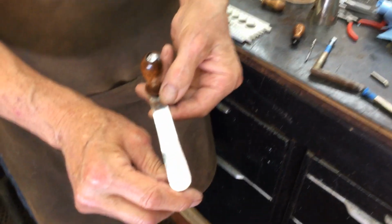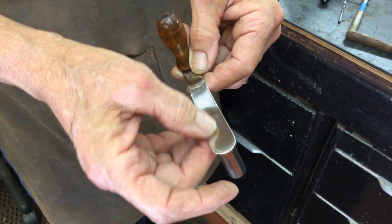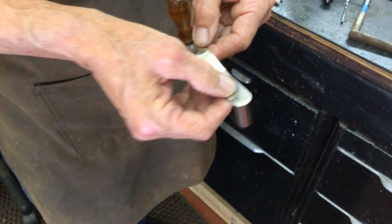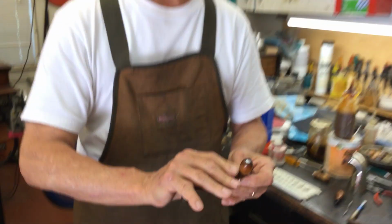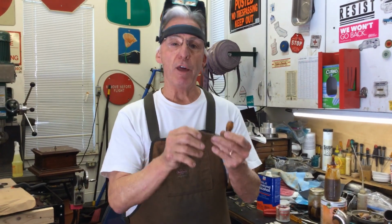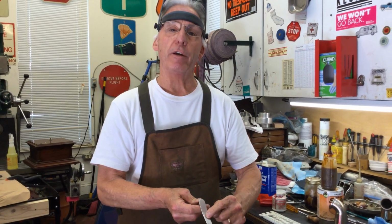I did that on this one. Copper first, to cover up the rust. They copper plate, they pull it out, they polish it out, make sure it's smooth, then they nickel plate, then they polish again. And this way you don't have rust marks in your plating. Is the rust still there? The rust isn't there. After they put it in the acid bath that rips off all the old nickel, the rust goes away, trust me.